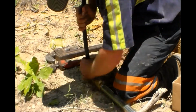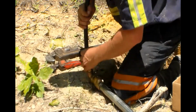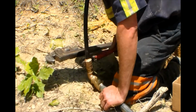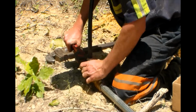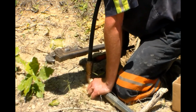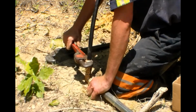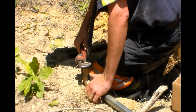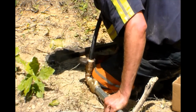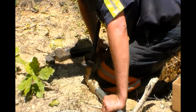And also, on those CTS fittings, when you tighten them down, they will actually bump up solid to where you can't turn them anymore. I mean, obviously you can force them and break them, but they won't go too tight, because on your older compression fittings, when you tightened them down, you'd actually cut your water line in two if you went too tight. And the way they've got the newer ones designed, they won't let you.